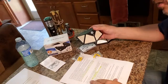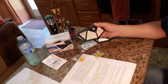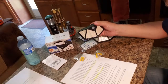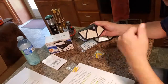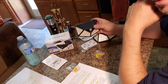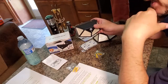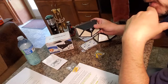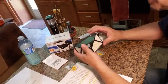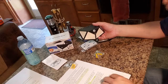The price is really good for what you get, especially given the lithium-ion battery. The battery is rated around 2200mAh, but when I tested it I got around 1850 to 1900 actual milliamp hours for the cell. Internal resistance was around 150 milliohms, so they're average cells. The rating wasn't quite met but 1850 to 1900mAh is actually pretty good, and there's one cell in each unit behind the back panel.